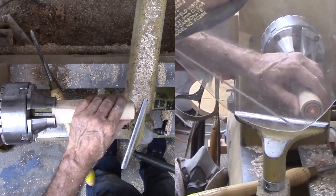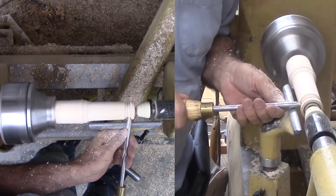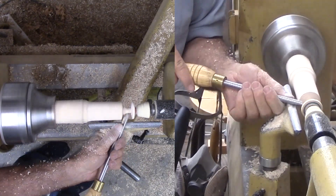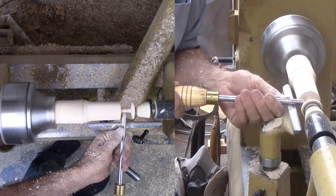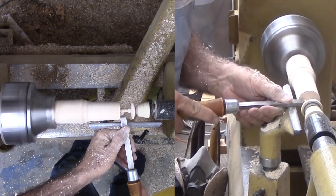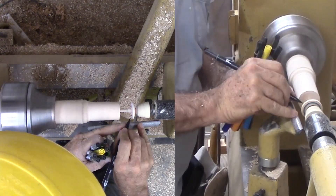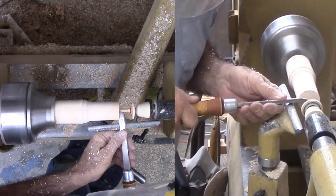With my spindle gouge, I take some heavy cuts to remove wood at the top of the top, then work down removing wood and shaping the top side and center spindle. Then sand this just a little. For the top side of the top, I remove most of the wood with a spindle gouge but finish up with my skew for a better finish where I can, then just a little fine sanding. I cannot put enough pressure on the top side to use a texturing tool, but the colored pens come in handy for a little top color. After all, most of the time I cannot see the bottom color when the top is spinning. Again, a little lacquer to seal the color, then part off the top.